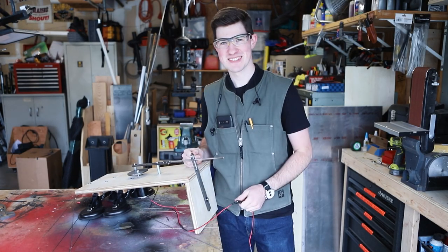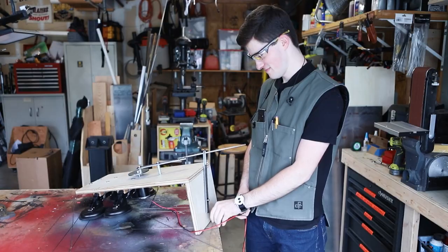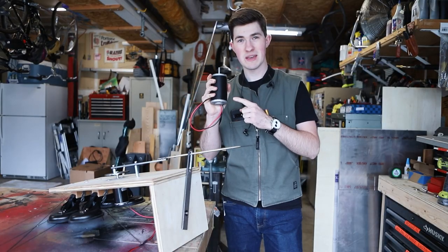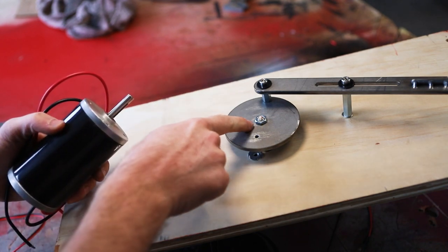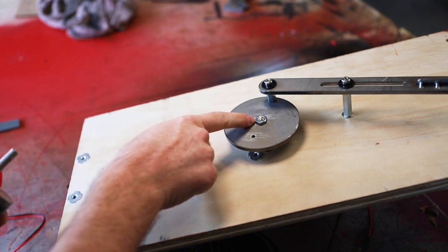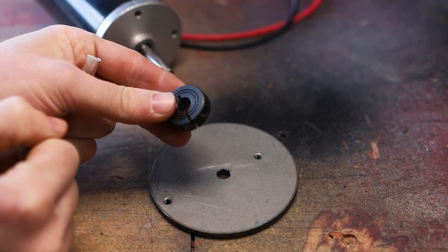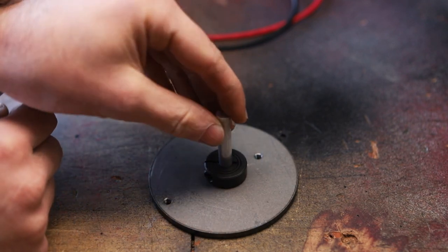It's loud and clanky! This is so ridiculous. That motor is way too underpowered. I bought a new motor — it's the same one I have on my knife gun. But the challenge is the shaft is keyed and not threaded like the old motor. I held the old one on with a jam nut, but I can't do that with this.